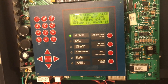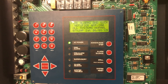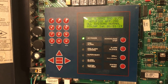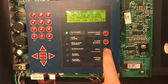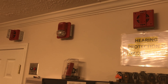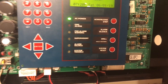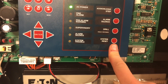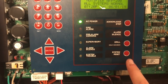Here you have your Acknowledge or Step button, which lets you scroll through different events on the panel and acknowledge them to make the panel tone stop. Here you have your Alarm Silence button, which will turn off your silenceable NACs. The Drill function — hold it for two seconds and it will activate any silenceable NACs. NACs set as non-silenceable will not activate; I have NAC four set as non-silenceable for my strobes. System Reset also doubles as your lamp test — when you press it, the tone and every LED and LCD digit will come on.